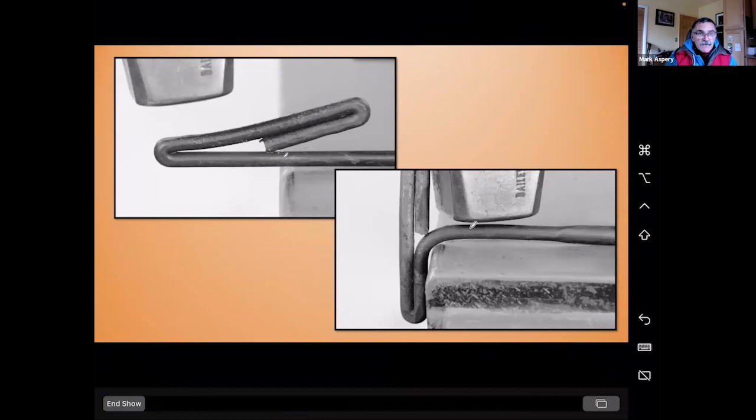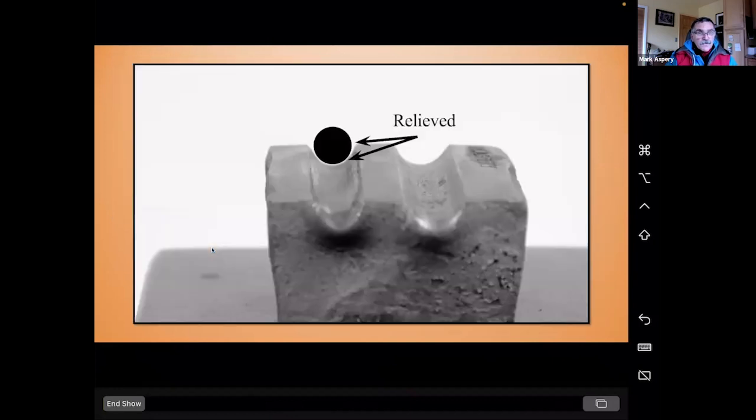And here I am, I've made the bend, and what I want to do is I want to have this stock come midway along the handle, and you can play around with this last bend to get that bar in the middle. So this is your chance just to play around, get it in the middle, and then we can move on. The next thing you're going to need is to make the flutes, which is really like a drill bit, to make the flutes of this gimlet.